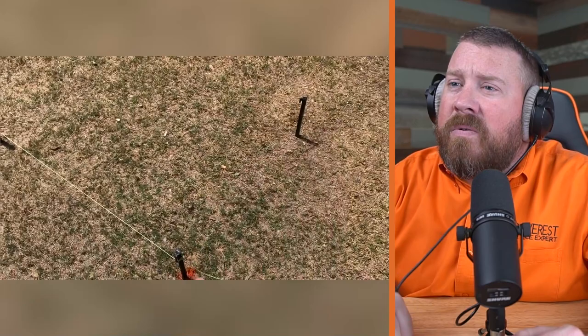We did a review video on some guys doing the Pythagorean theorem a little while back, the 3-4-5 method. It's a great method, and the nice thing is it's scalable, right? If you have a project that's 1,000 foot one way and 1,000 foot the other way, you could do 30 foot, 40 foot, 50 foot to make sure that corner is very precisely 90 degrees. It's a great tip. So if you guys are out there trying to square a corner, one leg is 3 foot, one leg is 4 foot, the diagonal should be 5 foot, and you know you're square.